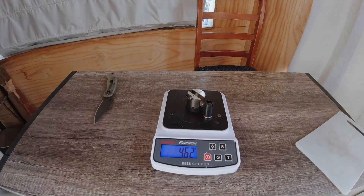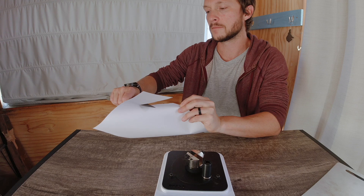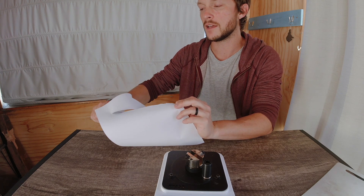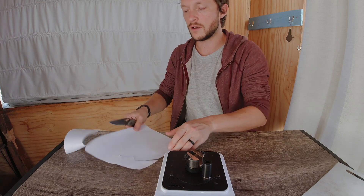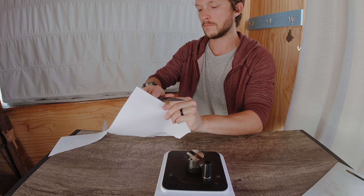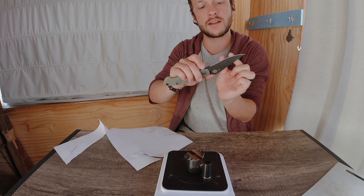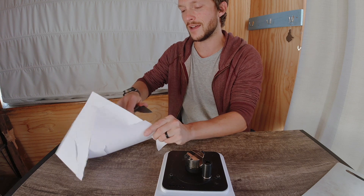462 is not bad. Let me get a piece of paper and see how it does. Out at the tip, she's still cutting paper well. Still cutting paper decently at the middle. Down at the heel, we're still getting through paper — but in the middle, no. There's an unidentifiable dead spot, although it skipped around but kept cutting. Flipping it around — so there is a dead spot in the part that was the main contact point against the rope, kind of from there to there. This portion of the edge is still cutting, and this portion is still cutting. Very interesting results — dead spot right there.